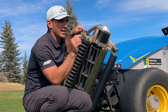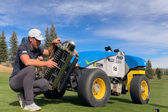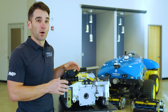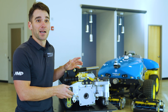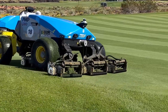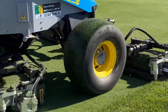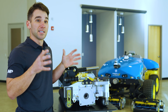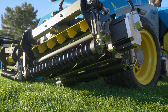If the gap between your reel blade and bed knife exceeds three thousandths of an inch, you will not be cutting grass. Maintaining that gap at three thousandths of an inch is really quite difficult unless you have properly machined, high-precision parts that eliminate any backlash in the joints — which could allow your reel or bed knife to move as the cutting unit bounces through the ground. We put a lot of effort into reducing backlash in all joints of this cutting unit to make sure the reel stays in a solid position and that gap is not fluctuating as the cutting unit moves through the ground.